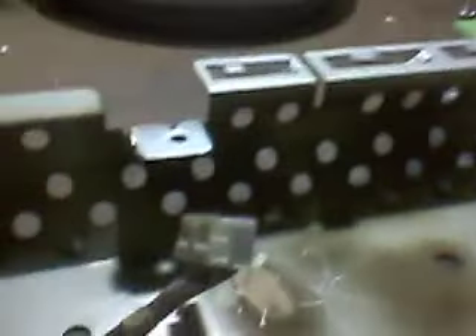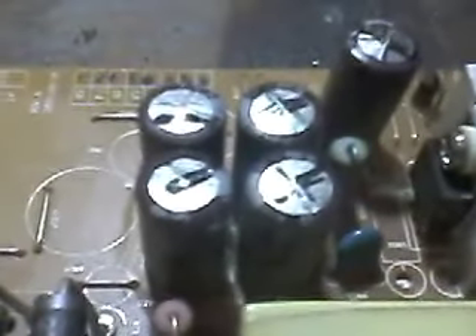It was fiddly but I managed to get the plug undone — now this board is loose. I'm going to pop these out and put the new ones in. I'm getting 24.4, 24.2 on the capacitor tester. It's supposed to be 470 microfarads and it's reading 24.3 — which is absolutely useless. That is obviously the main fault.